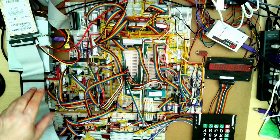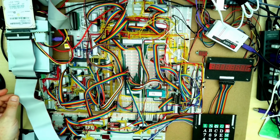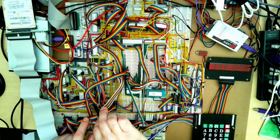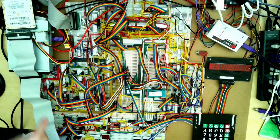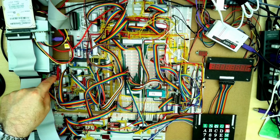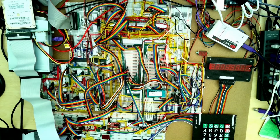Then over here, this is a video controller. There's a 15-pin VGA connector over here, and this is a monochrome display adapter compatible video controller. We've got a 4K dual port RAM down here, which simplifies the interfacing. It's using a Motorola 6845 compatible video controller, and one thing I did change is that it's now outputting VGA compatible output rather than the original legacy monochrome and CGA output, just because I don't have any monitors capable of taking that. So this produces VGA compatible output.